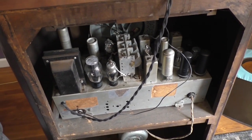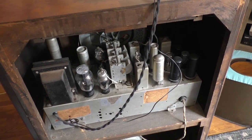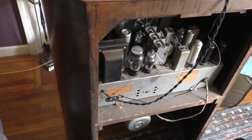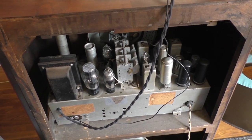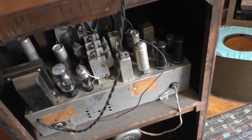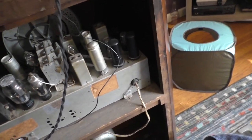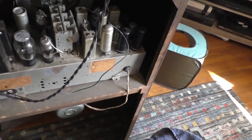I'm not sure if I mentioned this in a previous video, but I was having issues with audio buzz — all of a sudden it would produce a loud buzzing sound. It turned out to be an issue with the volume control rheostat. In my troubleshooting, I replaced the two audio tubes, the 6L6s. I bought two Reflector tubes from Russia and put those in the audio amp circuit. They sounded pretty good but didn't solve the problem. So I put the original 6L6s — I think these are RCAs — back in, and it's been fine ever since.